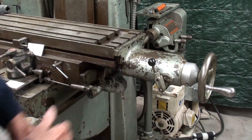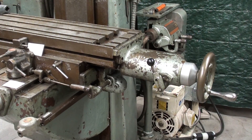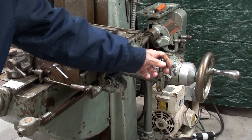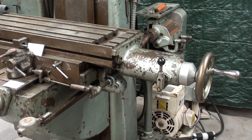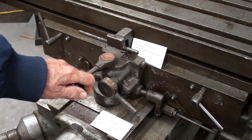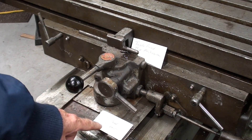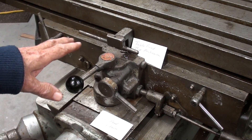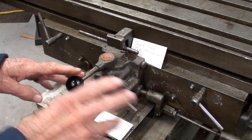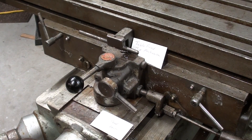Also, this makes the footprint of the machine about 10 inches longer than any other machine. Never walk away while the power feed is on. I looked in the instruction manual — this is called the table feed trip mechanism, and this one is called the table feed release lever. They're really about the same thing, so you have control of turning it on and off right here without moving your hand a full 2 feet to the other lever.